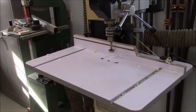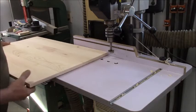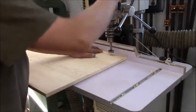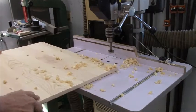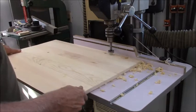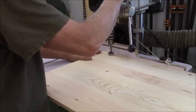We're down to the last two doors — these are the big ones on the bottom of the peninsula. I've got to shuffle up. I decided to move the center of the bigger door hinges out to three and a half inches up and down.